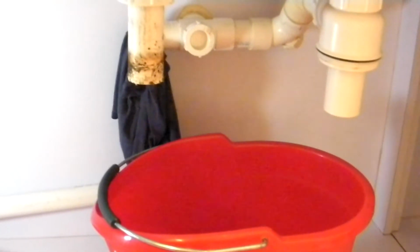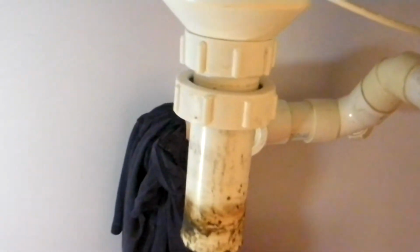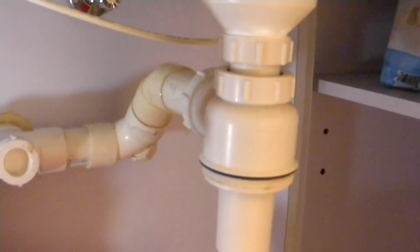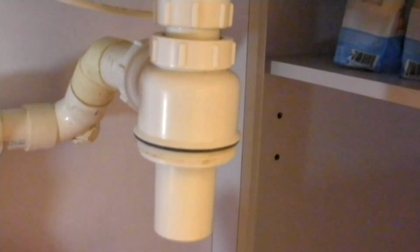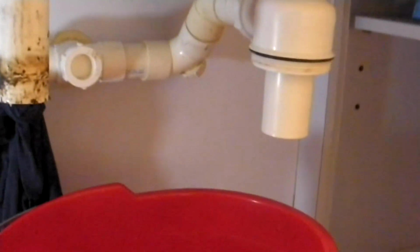Well, it's the next day, and we lived with the drain into the bucket routine, so we could do things like wash dishes and other stuff like that. There's a rag stuffed into the pipe because it's after the trap, and that allows sewer gas to escape, although that little part there probably allows sewer gas out the bottom there. I could have put the trap on there, but I didn't. However, it's better than nothing.